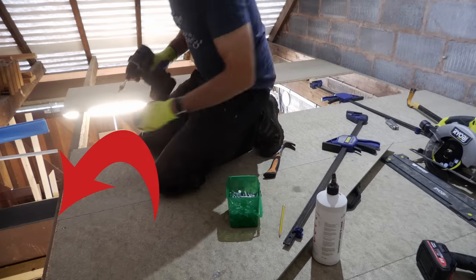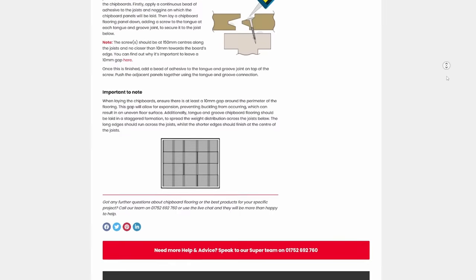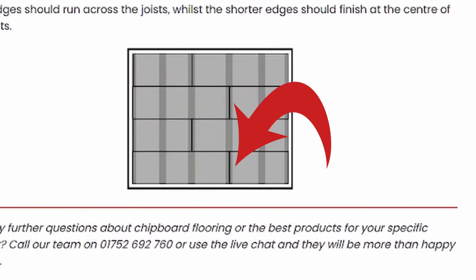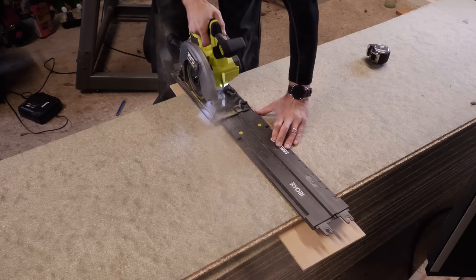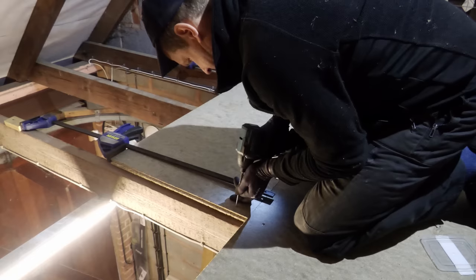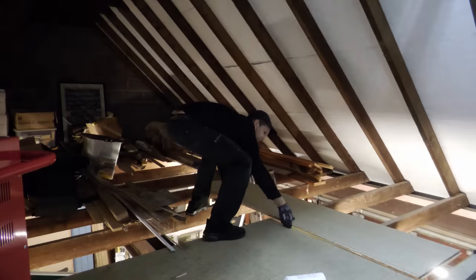The third point is staggering. Almost as soon as I'd posted that video in the summer, people pointed out I should have staggered those floorboards. Tongue and groove chipboard flooring should be laid in a staggered formation to spread the weight distribution across the joists below, with the long edge running across the joist and the shorter edge finishing at the center of the joist. I couldn't move those boards installed in the summer as they're all glued together, so to stagger the remaining boards going forward I started cutting half sheets, making sure they ended on a joist.